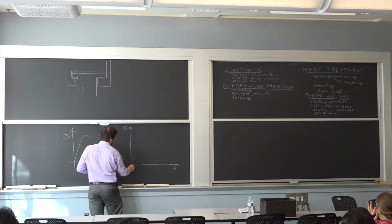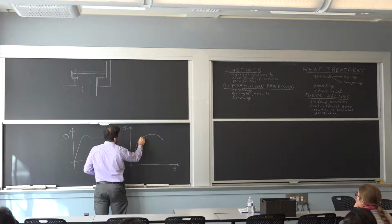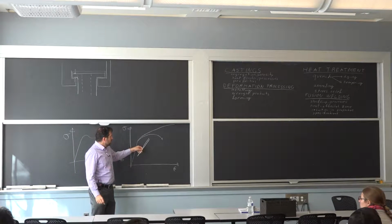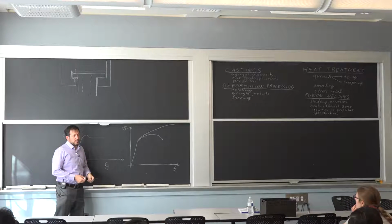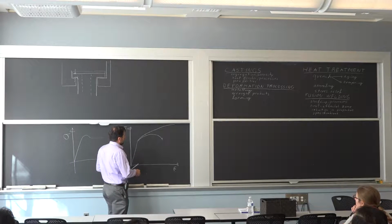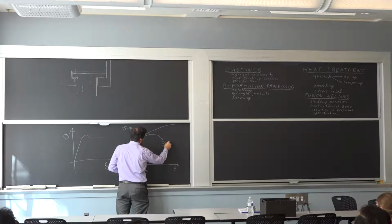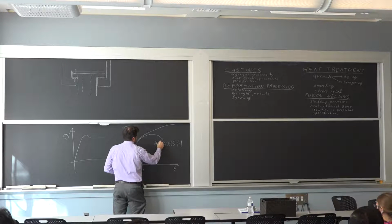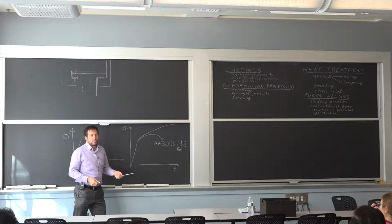and if we do the tensile tests, it's going to look like this. Now, we discussed together that in reality, the material is going to deform this way. So to the extent that you avoid the tension mode of failure, you're able to continue raising your flow stress in the material, the strength of it, by deformation. Typically for stainless steel or even aluminum, they'll have an H designation. Say I'm just coming up with one here: I have a 3000 series aluminum alloy that's got a certain hardening. Maybe it's got a number to it.